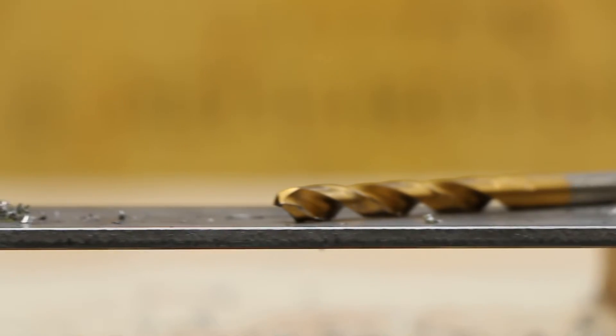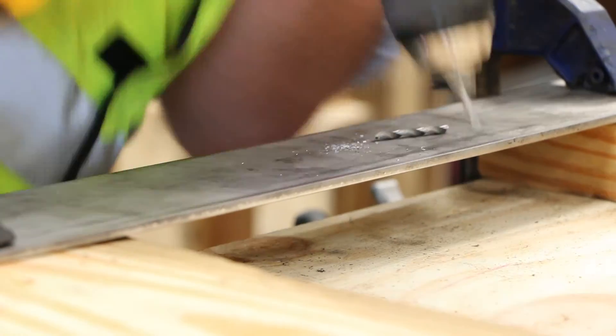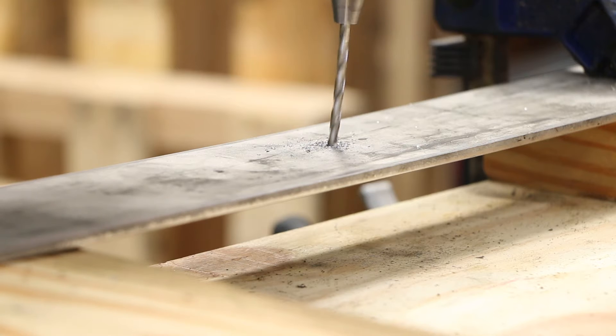For drilling, it's common knowledge that treating it like any other metal and applying sustained pressure until the hole is complete causes problems such as overheating and occasional breaking of the bit. If you continue to drill stainless steel in a sustained way, you're only making it more difficult the longer you keep it up.